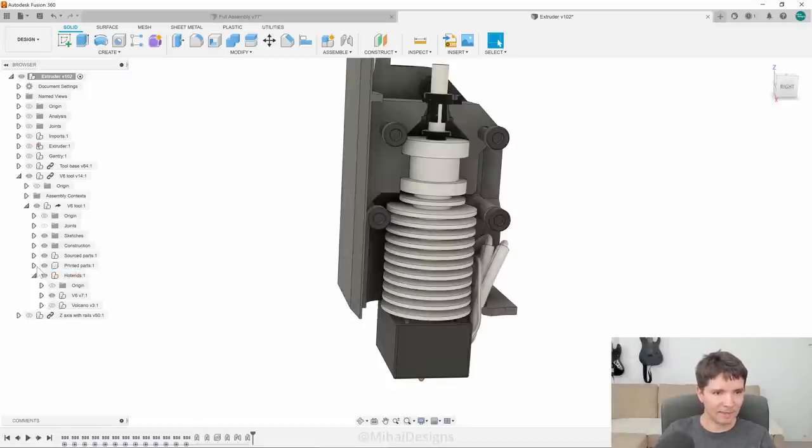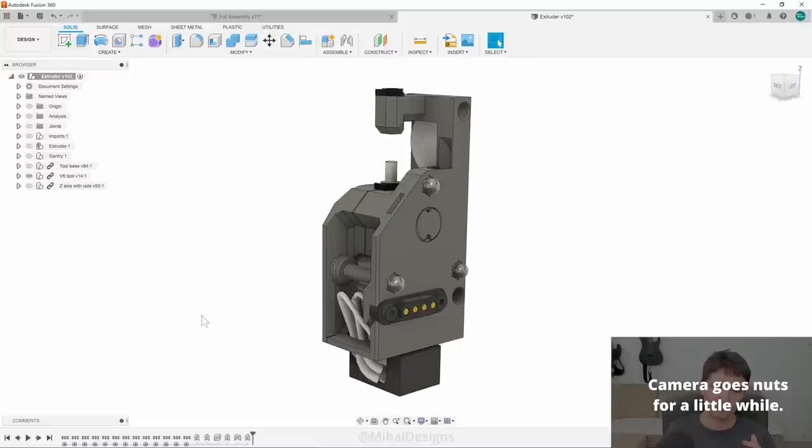Alright, I'm going to put the cover back. To achieve multi-material printing right now there are two main options. One is to use one hotend with one extruder and keep changing the filament, but what you end up with is a mix of the colors which you don't really want. So the solution is to have a purge block, which wastes material and takes a lot of time.